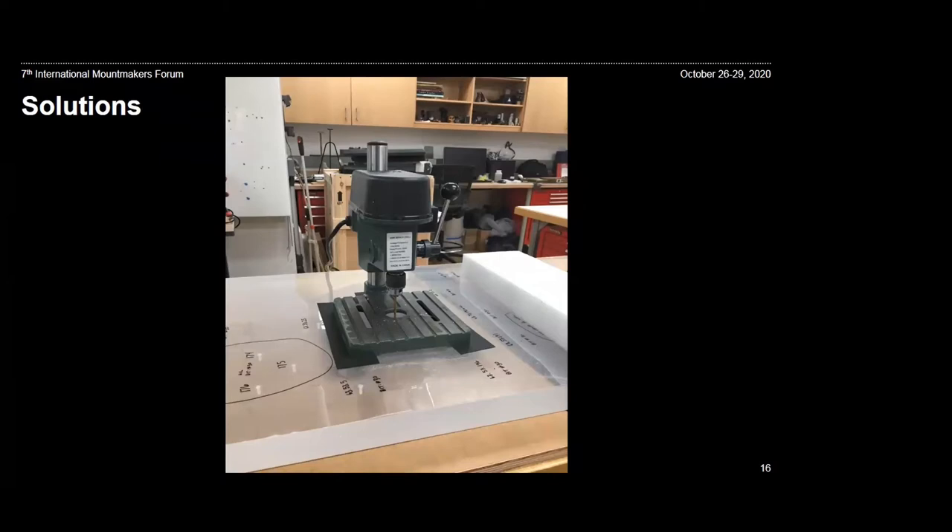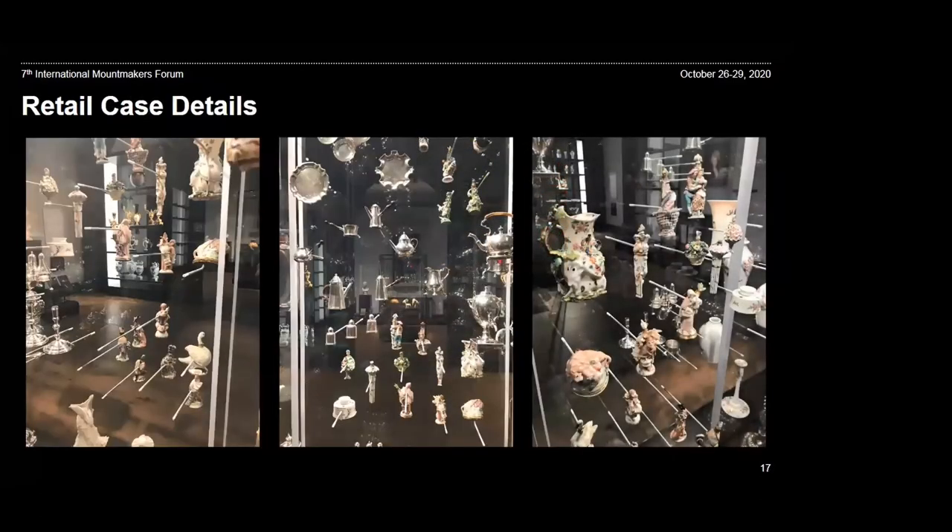All drilling into the final plexiglass panels was done with the panel laid flat and fully supported underneath to avoid stress on the plexiglass. We laid out each sheet of mylar on the plexiglass, taking care to align it properly and make sure that when the time came to flip the panel, one side corresponded to the other side of the same panel. When drilling, we left the protective plastic on the panel to avoid any possible scratching. With all this talk about the 3D mock-up, there's not all that much to say about the installation — rather formulaic and uneventful until the big reveal, which only underscores how fantastic it is to work in a mode of methodical pre-planning.